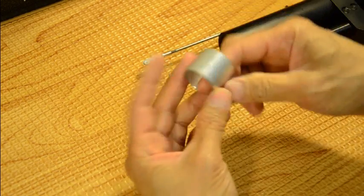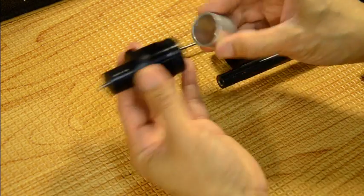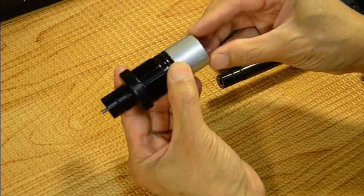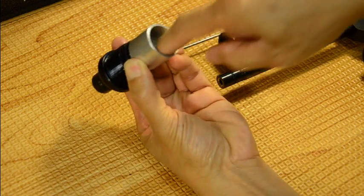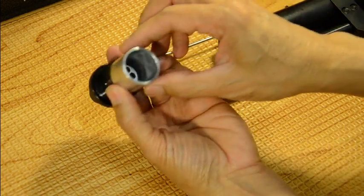What comes out next is your spacer. This valve sits on a spacer and the regulator sits here. Your regulated air is in this little small area. That's what the spacer is for — it's the reservoir for your regulated air.